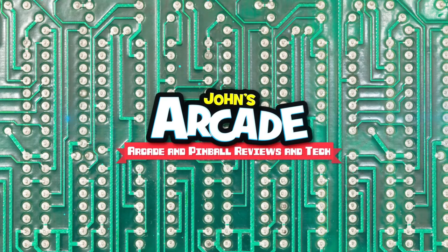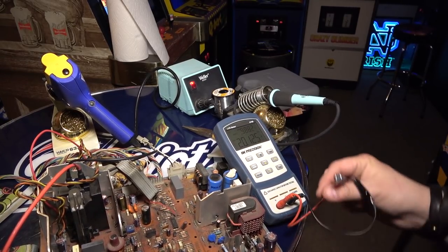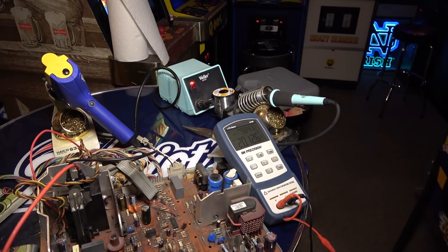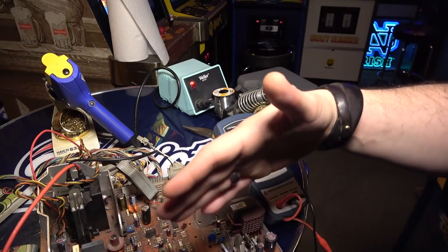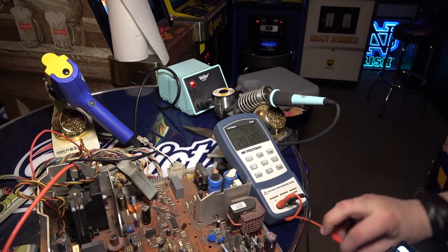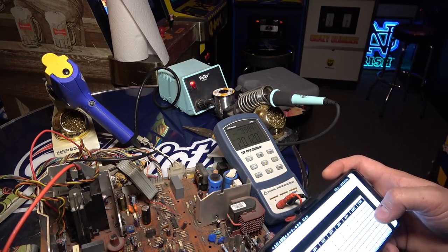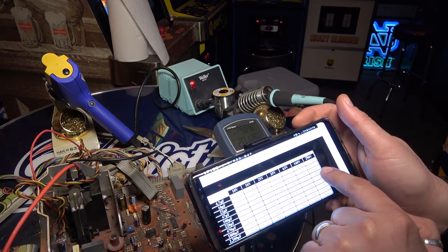Okay, I changed the battery and interestingly enough, the reading is actually different now, probably more accurate. So this cap again is a 22 microfarad. It's reading at 20, so that should be good. And the resistance here is 0.9 ohms. Now, if you go online, you can find charts that give you ballparks of what it should be, but really every manufacturer is gonna be different. Higher quality caps are gonna have lower resistance out of the factory. But anyway, on this chart, I think it's on the EV blog, for a 250 volt, 22 microfarad cap, you basically want it to be 2.9 ohms or less, okay?